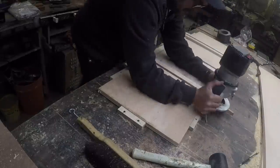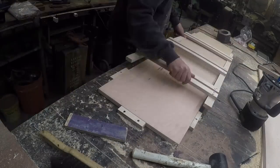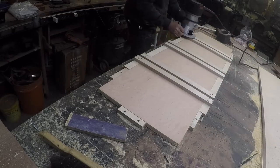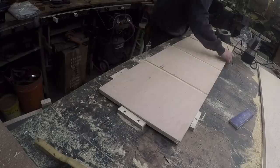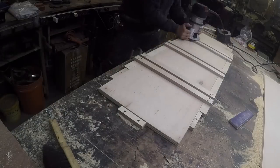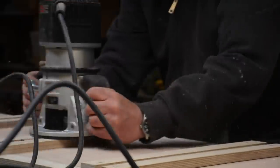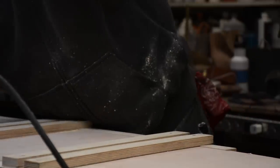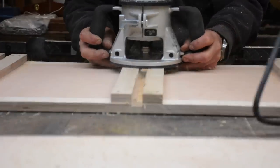I tested it to make sure the piece of wood fits snugly. The one thing with a system like this: you've got to be sure the router bit is not cutting the inside of your jig. One way I make sure is by drawing a pencil line on the inside — if that pencil line stays there, I know I'm safe. Otherwise it's taking off a couple hundred-thousandths at a time without me realizing it, and by the end the slot is much wider. So if you try this, put a pencil line inside of those two guides.